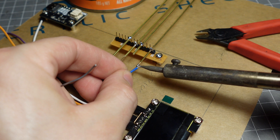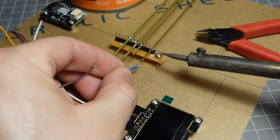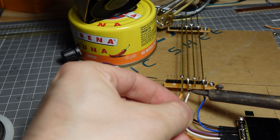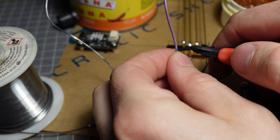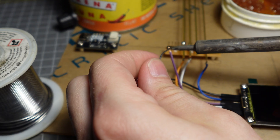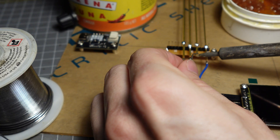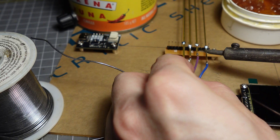This screen is an I2C screen, so the wiring is relatively simple. The display just needs power, ground, and then a clock and signal wire. It was a little difficult to solder nicely to the ends of these wires — perhaps if I used some thin brass tubing that would be easier — but it turned out pretty well in the end.